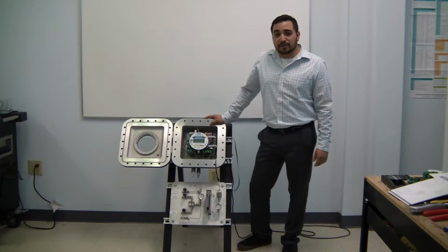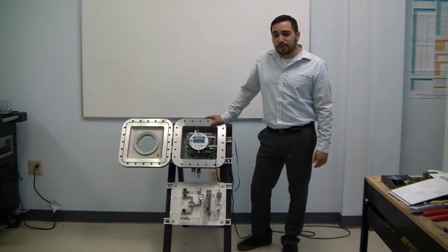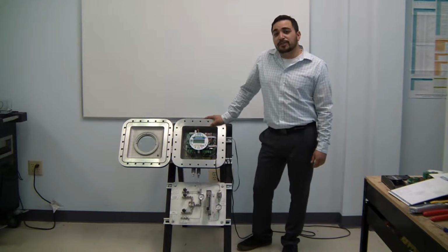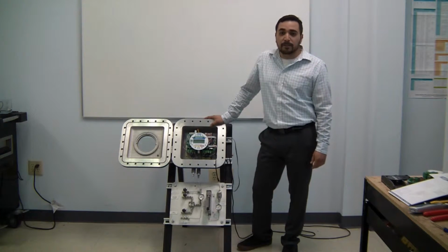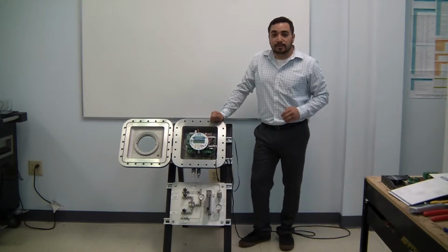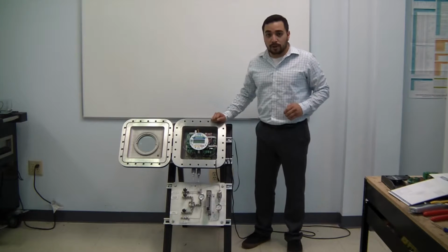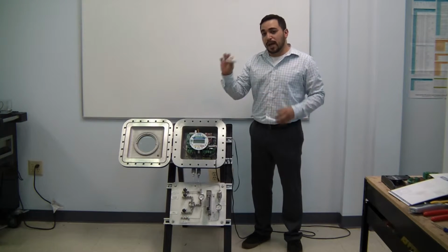ZEGAZ Instruments analyzers are networkable using the Ethernet port and utilize a web-based user interface. From this interface, you can download data and manipulate some of the configuration settings. There are two ways you can network your analyzer. You can utilize the Ethernet port and connect it to an existing Ethernet network, or by using the factory supplied micro router.